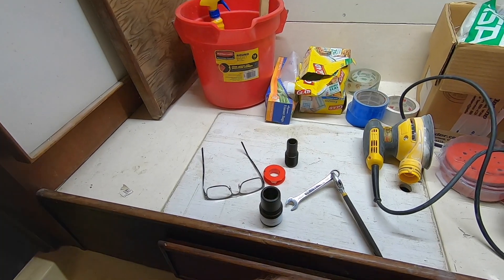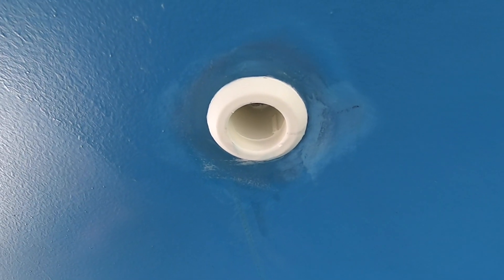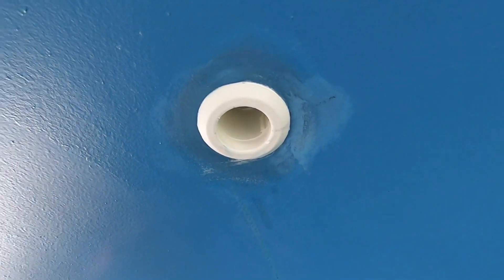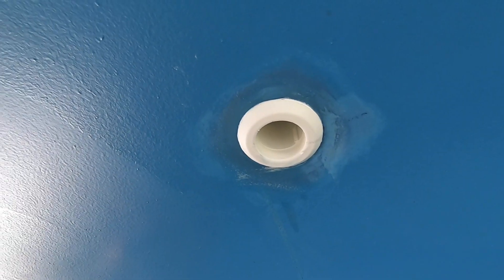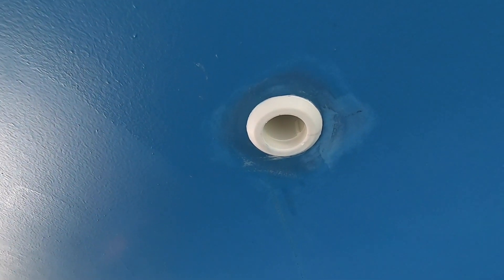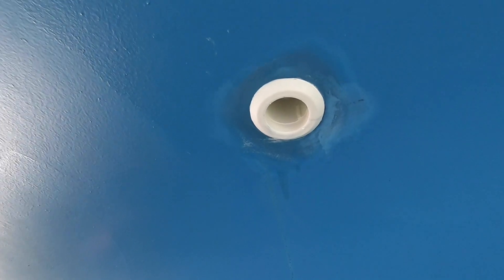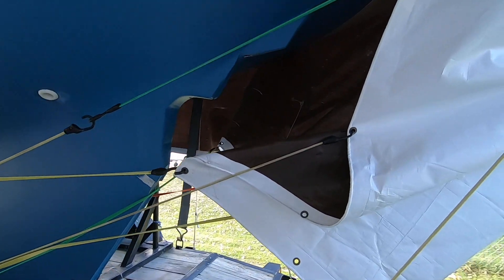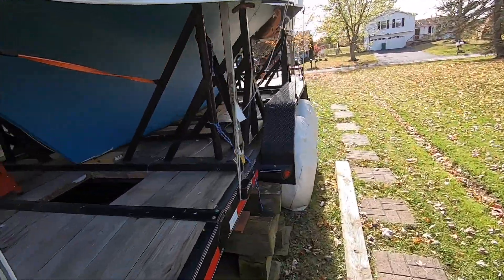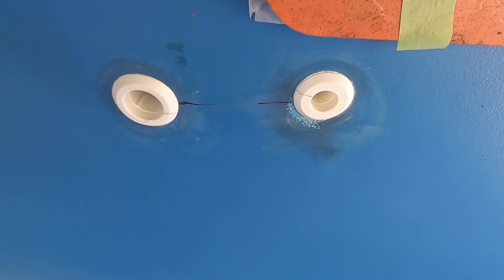Here's a shot of the outside. I cleaned up some of the paint before putting that in, just to get it down to the gel coat instead of on the anti-foul. I don't think it really matters, but I did it — that's why it looks ugly. I've got to put another coat of anti-foul on anyway. And here are the two through hulls for underneath the galley — the water inlet and the water outlet.